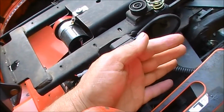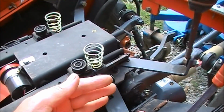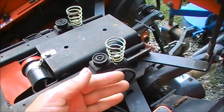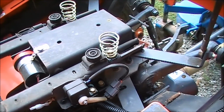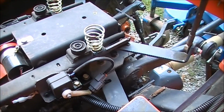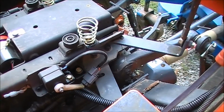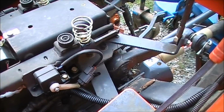And that's kind of like the difference between tractors. Some tractors don't have a position lift. It's either up or down, it's either on or off. You kind of got to turn it off when you get to the height you want it at, and it's hard to return to that spot because it's either up or down. Whereas these tractors have a position lift, so you can put it at a certain position and return to that position when you're mowing and stuff like that, or if you're running a plow, like a single bottom plow.